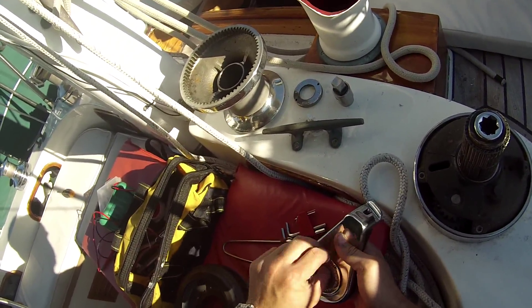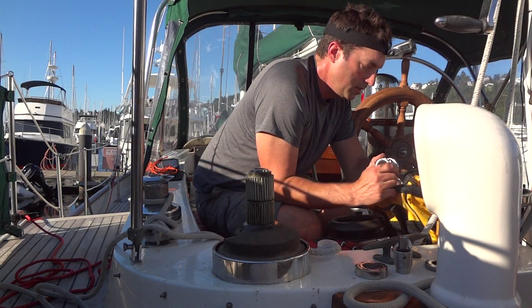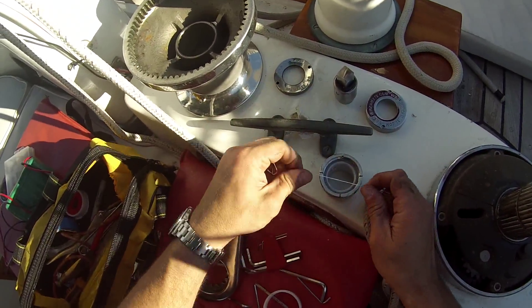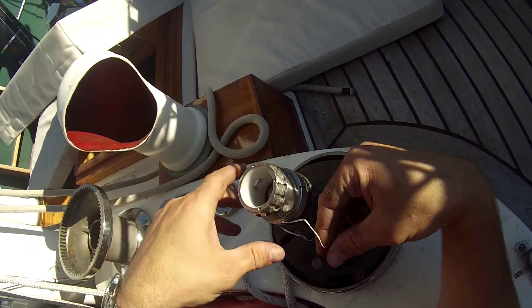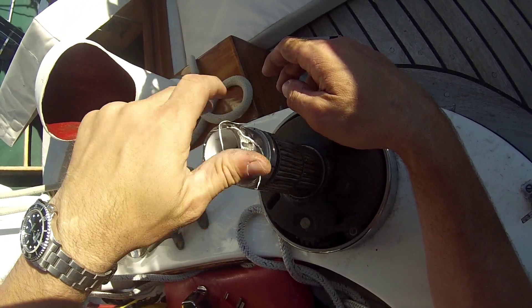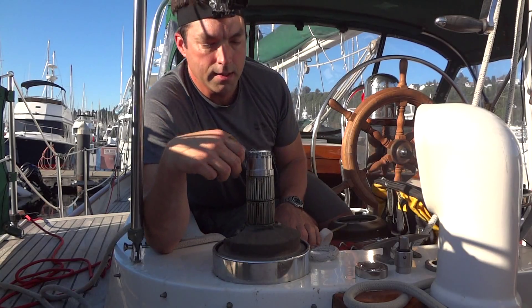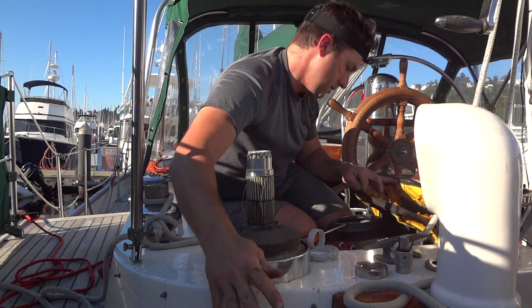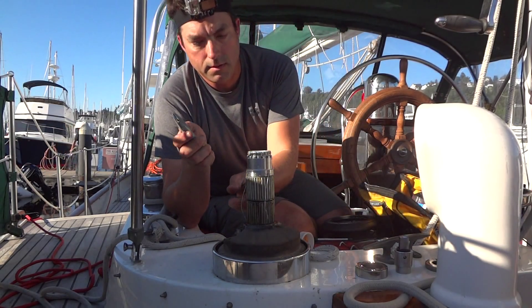You do the same thing on the Winchmate. One weird quirk is they want you to use some dental floss to gauge how tight you put this extension on. So it goes in these slots. You want to get it to the point where it won't easily slide through — so we're good here. I need a razor knife to get rid of the extra floss. You just leave the floss in there.